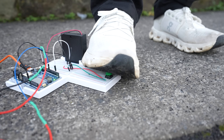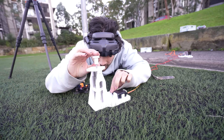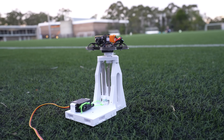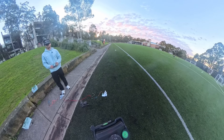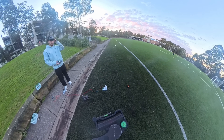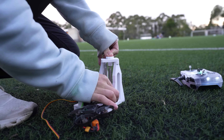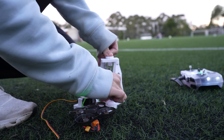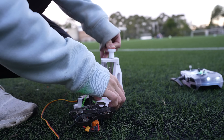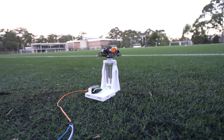That's a high-tech contraption. Now we load the launcher. I realized that when you arm the drone there's a very slight lag spike, and by the time it smoothed out the drone was already on the ground. So the idea of launching it and then arming wasn't going to work. So I tried it again — but this time we're going to arm the drone first and then launch it.